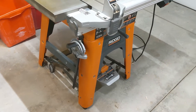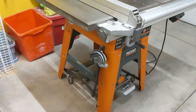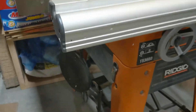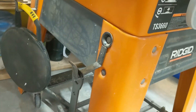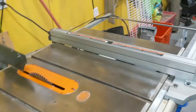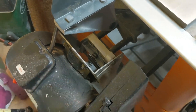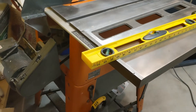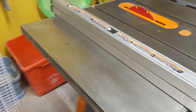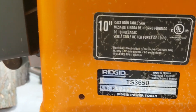Really the only difference I've found between the 3660 and the 3650 is this metal guard support — it's moved on the 3660 to up higher, mounted into the upper piece rather than being lower. In poking around the saw I can't really see any other differences. The spring placement is a little different on the motor as far as self-tensioning, but it's the same motor otherwise. They're identical saws as best as I can tell.